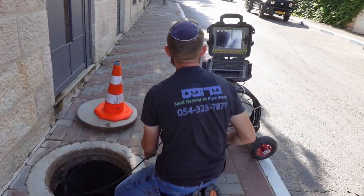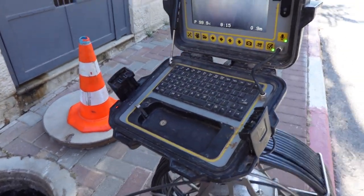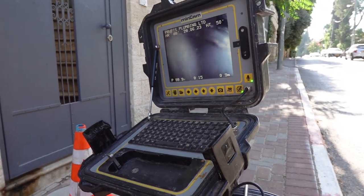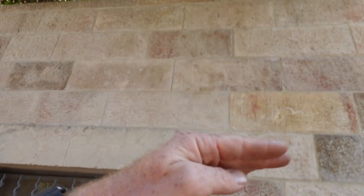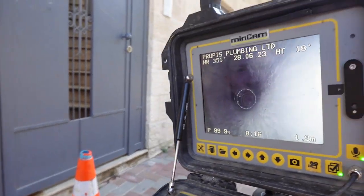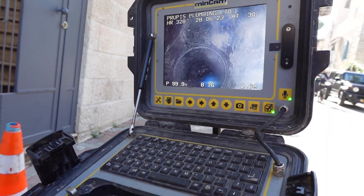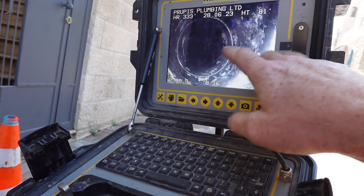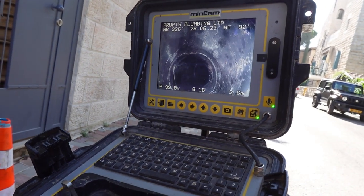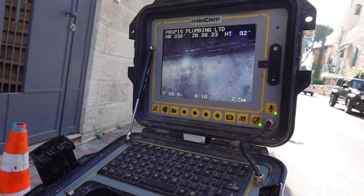This is a connection - we want to go a little bit up and take a look at it. That's going to be electro-fusion, something to take a look at at some point. But I think we're too low - we're gonna have to be closer to the T near the ceiling. We're gonna go up until we get to the T and then look at the bottom part below it. We got the T over here. It's dripping down below the T, so the issue is either in the T itself or right below it - those are the only two options.